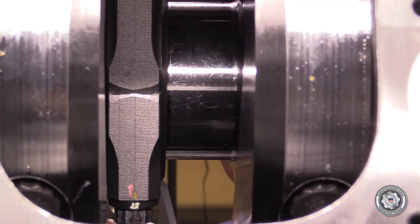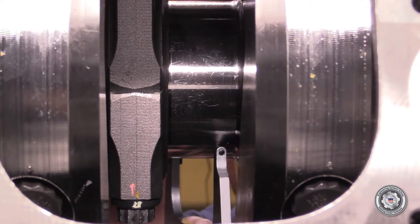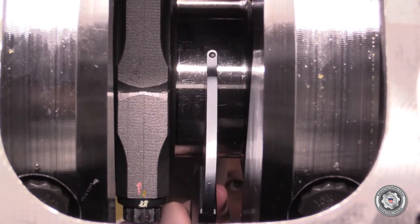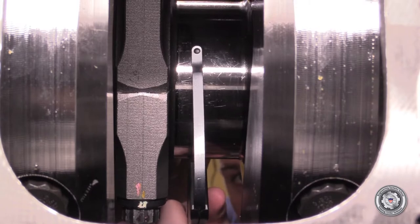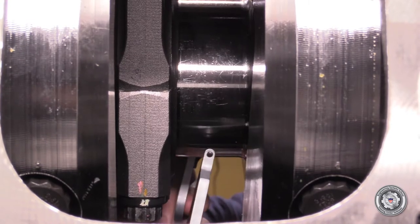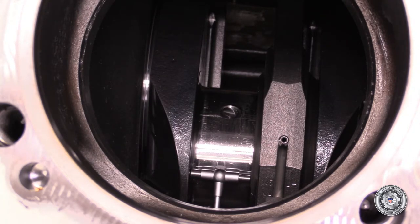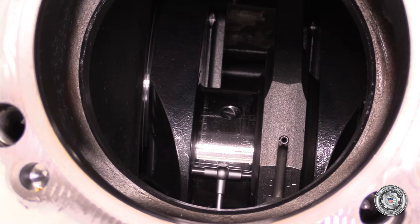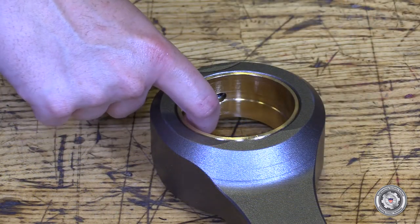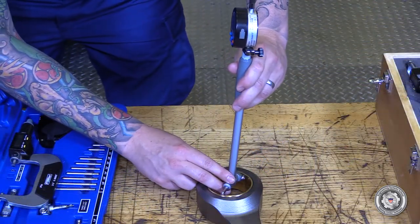There are four possibilities of bearing sets for the connecting rod bearings. Clarification that the crankshaft connecting rod journal has not been previously machined can only be verified by taking a measurement. Take extreme caution when taking the crankshaft measurements to avoid scoring or damaging the crankshaft with the micrometer. Measure the crank pin diameter per the maintenance procedure card. Using a snap gauge and micrometer, measure the crank pin length for the connecting rod at the crankshaft per the maintenance procedure card. Taking care not to measure at the lube oil groove, measure the piston pin bore in the connecting rod per the maintenance procedure card.